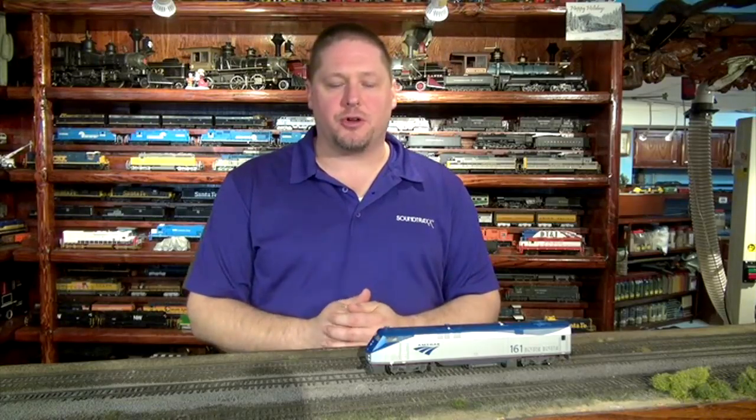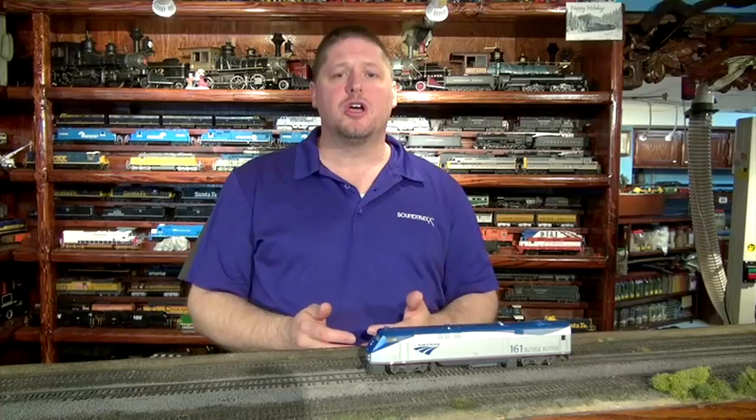For the example, the locomotive we have here, a P42, the GE typically would run to notch 6, and the cool part of our HEP mode is, the dynamic digital exhaust, or the DDE processor, takes over. So if your locomotive needs more power, in the case of the F40PH, the diesel engine will intensify as it starts to need more energy. In the case of the P42, the diesel engine can notch up and also gain intensity if more power is needed. And then as less power is needed, the prime mover will drop, but because it's in HEP mode, it will never drop below notch 6. So that's how HEP mode works.